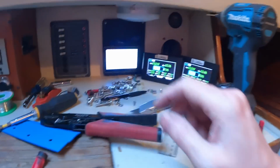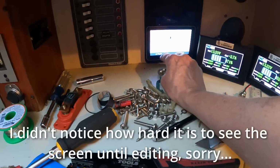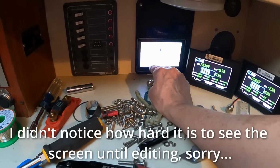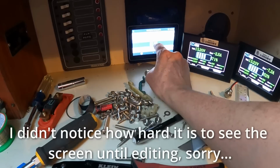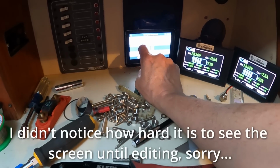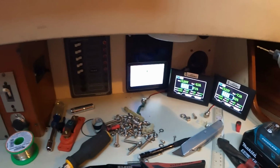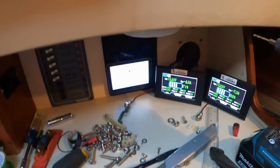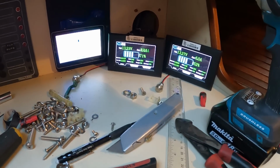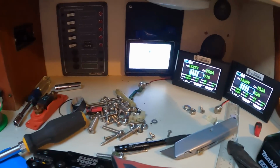Let me make sure that that is set to turn the AC breaker off, turn this back on, and see what the, I want to set the input limit to 30 amps. Let's say, it's old wiring, so I'm going to say 27 amps. Give myself a 10% buffer. Okay, let's turn the AC back on. How much are we going to start charging at? All right, seeing about 45 amps going in.